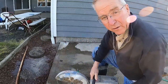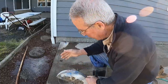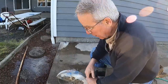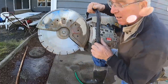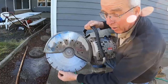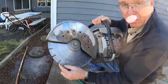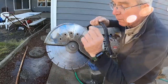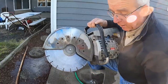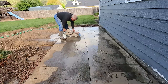This is known as a hot saw or a quickie saw and it's just an amazing tool for a lot of things, but nowhere more amazing than the fact that you can cut through concrete - in the same way that a hacksaw will cut through steel, which is counterintuitive. It's a chainsaw configuration with a circular blade where the edge has little bitty industrial diamond chunks held in a matrix at the edge of the saw. The edge of the saw is wider than the body so there's clearance. The very edge also has diamond pieces on it, so just the friction and abrasion of the diamond swirling at about 10,000 feet per minute rim speed coming in contact with the concrete wears it away really in quite a hurry. It's very helpful to cut concrete into smaller pieces so you don't have to break the full thickness all over the place.